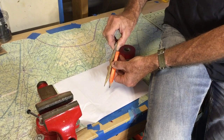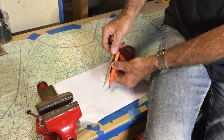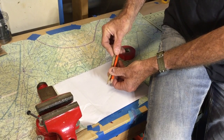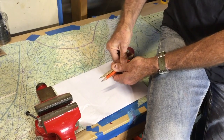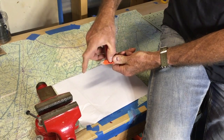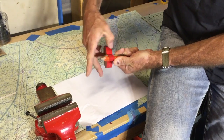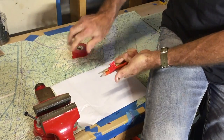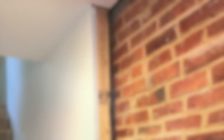You could even space between them with an object if you needed a much larger gap. For example, if you were doing a stone wall where the gaps were more like an inch to an inch and a half, you may want to space it out. In this case I'm just scribing a brick wall, so this should be more than enough — about a half to nine-sixteenths of an inch gap. So you take the carpenter's pencil and the dowel and just tape them to each other just like that.